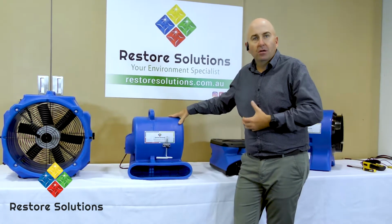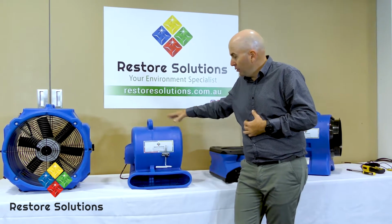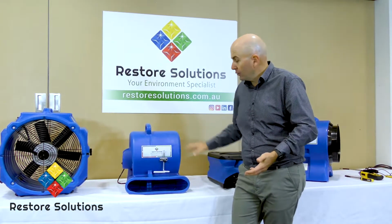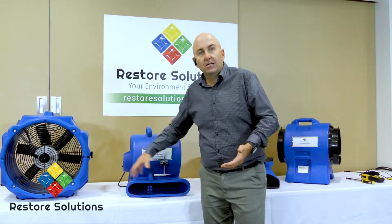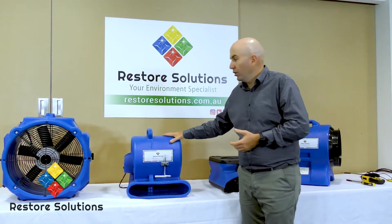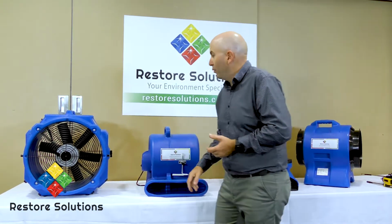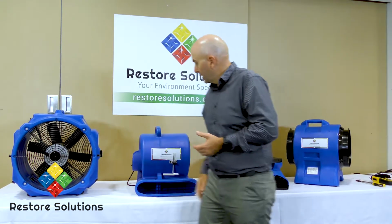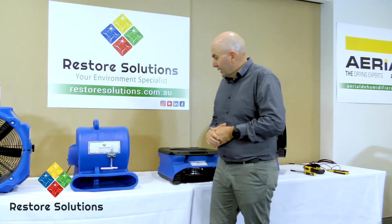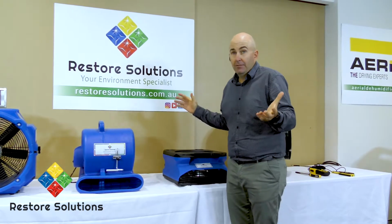Reason why these are still good, great to run your mats or boosts, or if you want to be running that sort of equipment. Or certainly if you wanted to tent carpet, or if you wanted to have a small area like that, or you wanted to put some pressure system off it, a ducting system or an injection system off it. So they do work quite well. So these are low amperage. These are between the 1.4 to 2 amps depending if it's on high or low. And these are between 2 and 2.4 amps depending from low to high. So, a well-built fan, again, but they're approved.